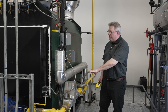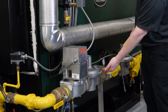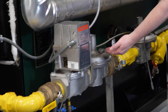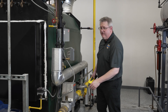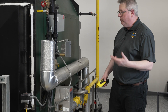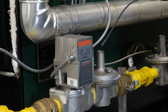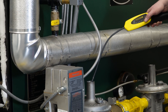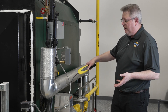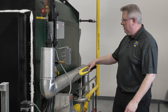Another spot to think about is a pinhole or tear in the diaphragm of our regulator. The regulator has a diaphragm that must move freely, and it has a vent connection that is typically piped outside so we can detect a diaphragm failure. If we remove the cap from the regulator or detach the vent, we can use a sniffer at that location — if it perks up, that tells us there may be a leak in that diaphragm, which will affect the regulator's functionality over time and we'll want it replaced.